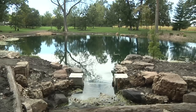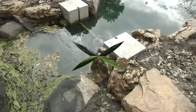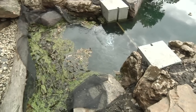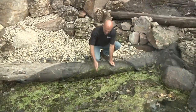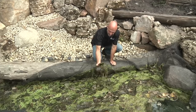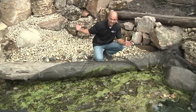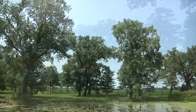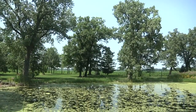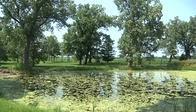Look at the surface of that pond — all of that duckweed that was on the surface got sucked right into this intake bay, and this is doing a great job of keeping the surface clear for us. All of this debris — just look at all this stuff getting sucked into our skimmer. This is just like one of our smaller ponds, just on a grand scale. The importance is we want to catch it now; if we don't catch it here, it's going to fall to the bottom of the pond, start to decay, and release nutrients into the water, which causes algae problems and water quality issues.